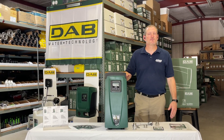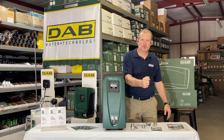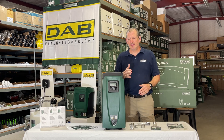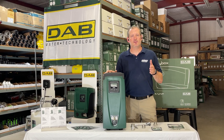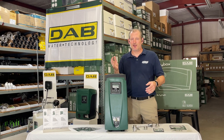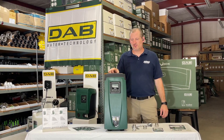This is going to replace the need for a large pressure tank and a booster pump with a pressure switch that turns on full speed and turns off every time. That's the reason they use those big pressure tanks that take up a lot of space in your garage or mechanical room — so their pumps don't turn on and off as often, wearing them out. This pump is okay to turn on and off because it's got a variable speed drive inside, allowing it to simply ramp up the speed of the motor to meet your demand and ramp it down. It doesn't come on with a hard opening start like most other pumps.